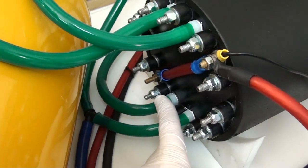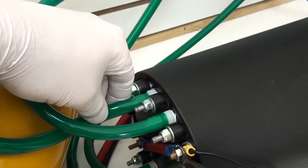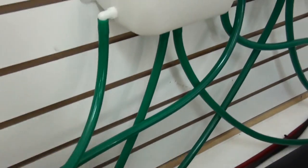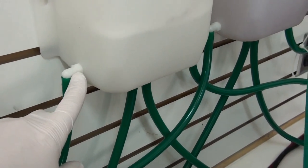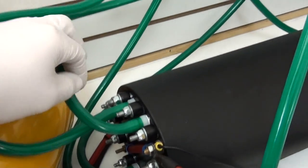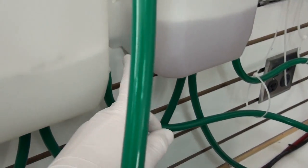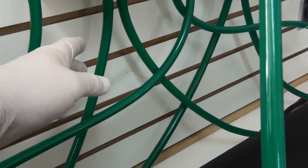So what you'll do is you connect your tubes to the appropriate tanks. For example, this hydrogen out, follow this around, goes to the input port of the hydrogen side, and then this oxygen out, you can see, goes over to the other tank on the input port. On the bottom side, electrolyte in.